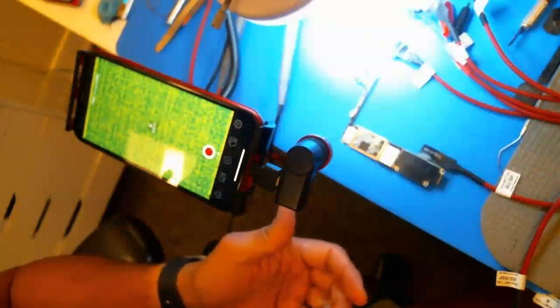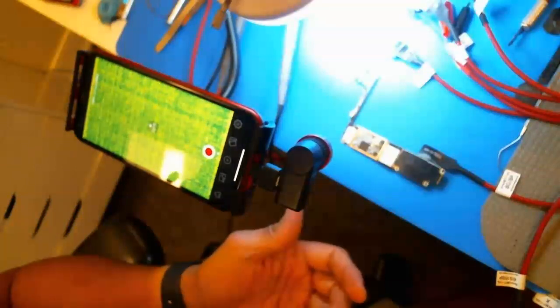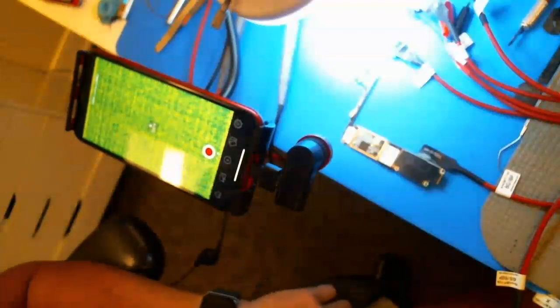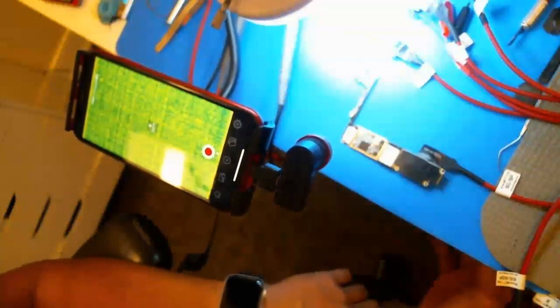Probably not for common shorts, because your VDD boost or VDD main is probably just a cap, and you kind of know where the location is. You can just pop it with freeze spray and you're done in minutes. Whereas the Seek accomplishes the same task, but it just takes longer — you have to mount it, start it up, plug it in. With freeze spray, you're just done.